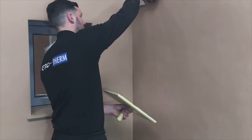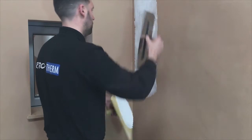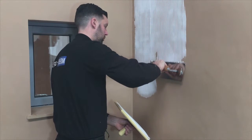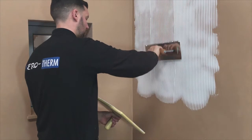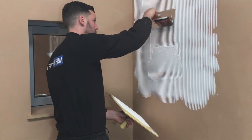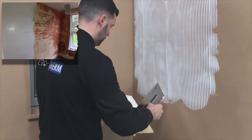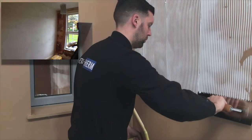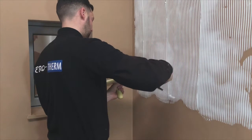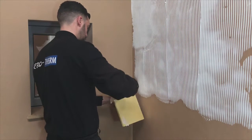Applying the Aerotherm with a 6mm notched trowel held at a 30 degree angle will create a series of 2mm ridges. The ridges can be applied in either direction, but it helps to be consistent. Ensure all edges and gaps are trowelled over to create 100% complete covering, otherwise low spots will be evident when the product is floated over. Starting at the top corner of your preferred side, apply each section of Aerotherm in columns of appropriate widths depending on your speed of application. Do not leave the trowel lines exposed before moving on to the next column as the material will dry and be difficult to float over. You should always work to the wet edge when starting your next column.